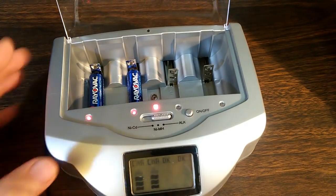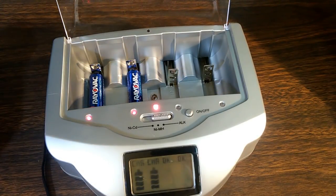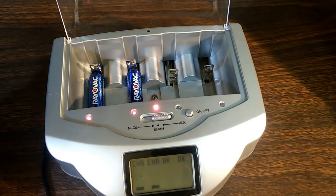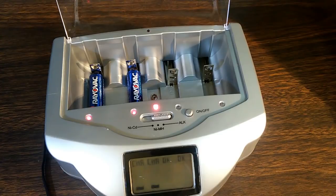And what I've noticed is when you measure the terminals of the charger, you get a voltage that's higher than 1.5, sometimes a lot higher, sometimes as high as 2 volts. Those are batteries which I think are on their way out. They're taking a charge, but when you're done charging them, the voltage is below 1.5 and it falls off fairly quickly. Within an hour or two, it's down to 1.3 or 1.25.